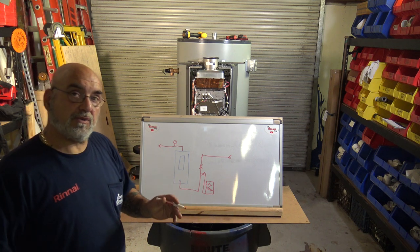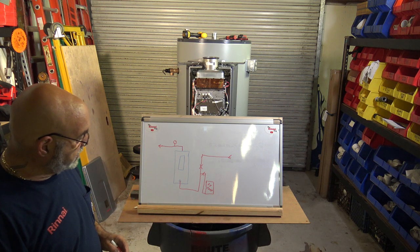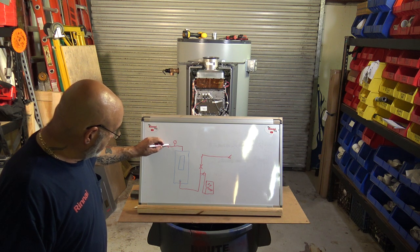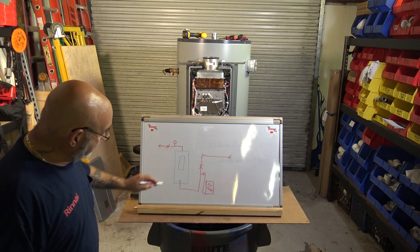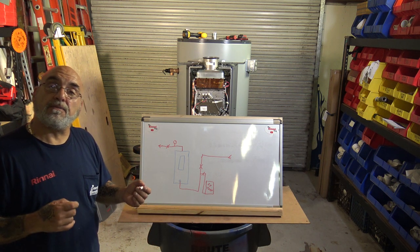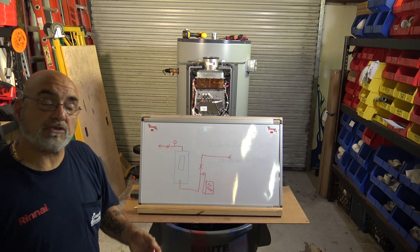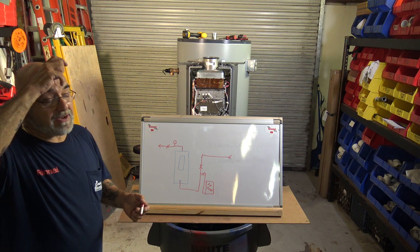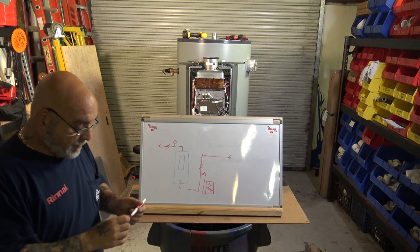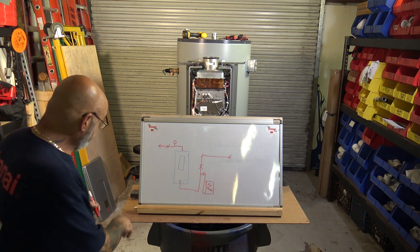So just watch how you use them. But other than that, you should be doing a floor mounted one, I think they make it in a 60 and an 80. So that is your standard cold water in, isolation valve, another isolation valve out of the tank. And then here and here, depending on what you use, you need to put dielectric unions so that you can redo the tank. Now, if you use ProPress or you use Uponor, then if you have enough pipe, you can cut it and then splice in a coupling. But other than that, dielectric union. So if you're going to use a union, make sure it's dielectric. All right, so